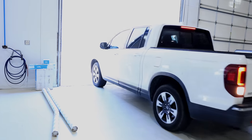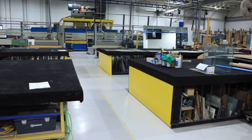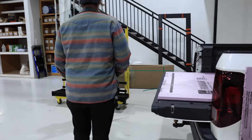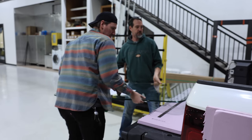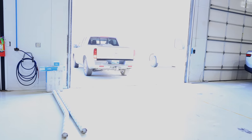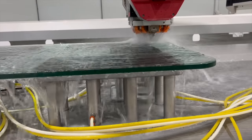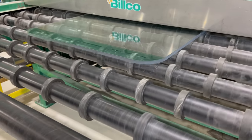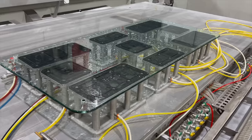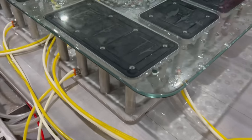I built a table a couple years ago using glass as the river between two cottonwood slabs, and I got that glass cut at a place in Oklahoma City called Glazing Concepts. For this project, I sent them my 3D model file so they could custom cut the glass with holes for the glass standoffs I'm adding to the tabletop. Using glass as the tabletop will allow me to carve a 3D pattern into the top of the table without requiring me to come back and fill it all up with epoxy to get a flat usable surface again. This place has some killer machines — especially the waterjet they use to cut custom pieces of glass. A half-inch piece of glass like this, custom cut to my specs, cost me $400. That's a lot of money for just a piece of glass, but I think the finished table deserves this extra touch. I chose not to have it tempered — the glass is a half-inch thick and doesn't really need to be.